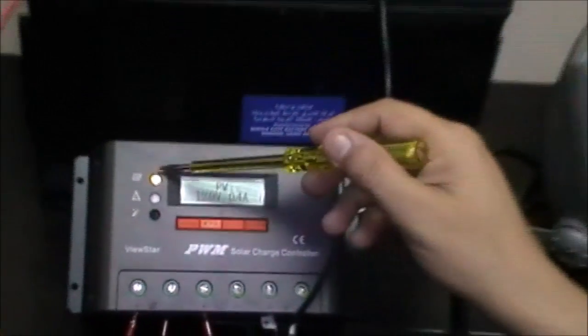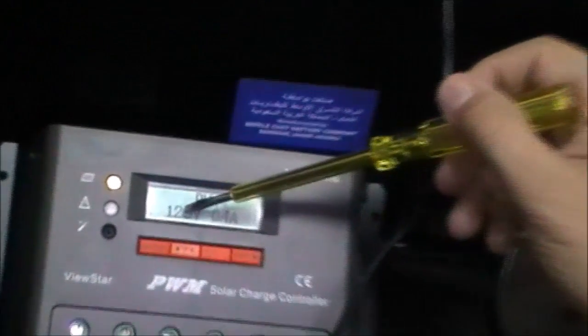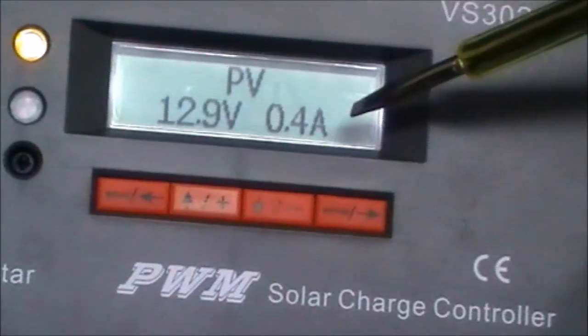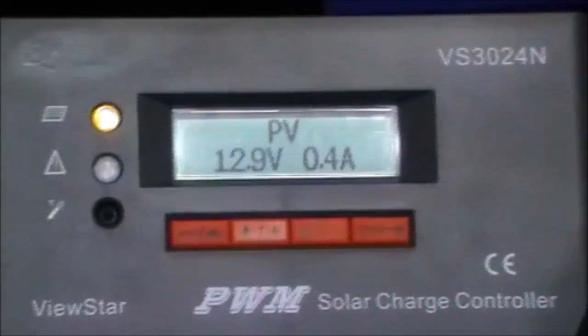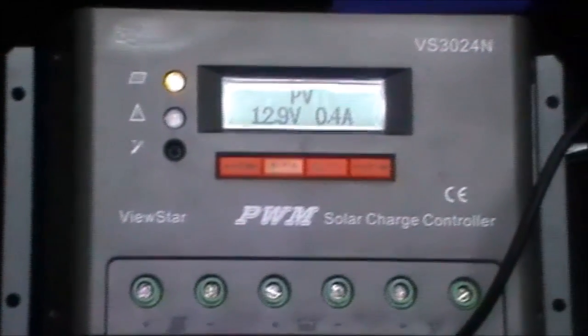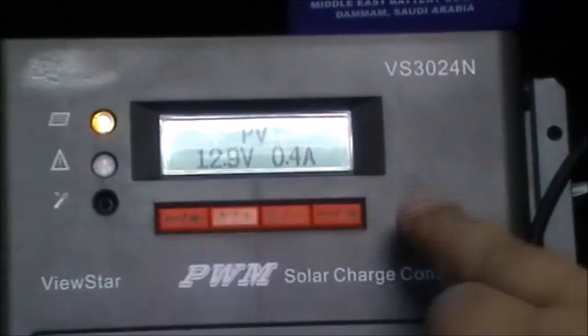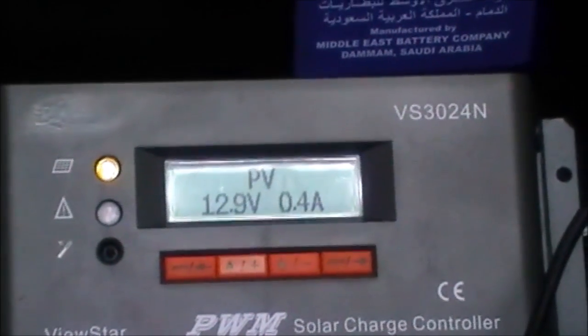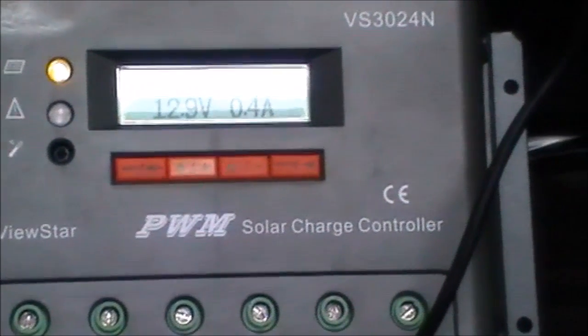Now I'll turn on the charging mode for the panels. You'll notice it is now charging with 12.9 volts at 400 milliampere. Accordingly, as the panel is charging — meaning there is sunlight — the load or light turns off. This is the beauty of this charge controller: you don't need to add what we call a photocell to the system. It is built in — there is a sensor or switch that tells the load to turn on once the solar panels are not providing voltage or current.